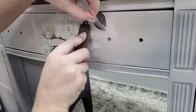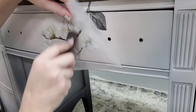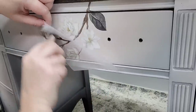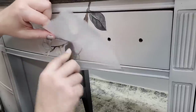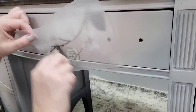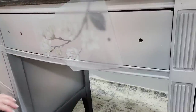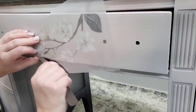I open the drawer so I can lightly wrap the transfer over the top section — this puts the cut inside the drawer itself, hiding that seam perfectly. I pick up the clear backing and rub the front of my transfer as I pull it back slowly, watching the clear backing to make sure I'm not pulling any pieces of the transfer up with it. You don't want to pull the clear backing away too quickly or you can tear your transfer. Any places I see pulling, I go back with my transfer tool and rub those down. Transfers with a lot of small details can take a lot more rubbing — be aware that very detailed transfers need more attention and time.